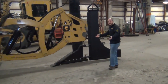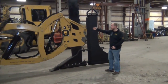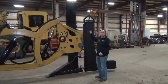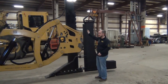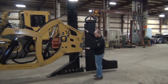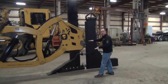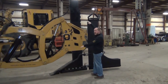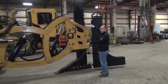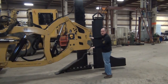Coming into play with the leverage I talked about earlier on the mounting plate is our adjustable shank. We have adjustments every six inches. The reason for an adjustable shank is so that you can fine tune your depth and your pull based on your design or layout to maximize pull. The best pull is a straight pull. You can set this shank to where you're going to be when you leave that outlet and when you get to the end of your line so that these links are nice and flat — you have a nice straight pull. You don't have links up in the air with a lot of leverage pulling and rocking this tractor. It's a nice, straight pull, nice and easy to move.